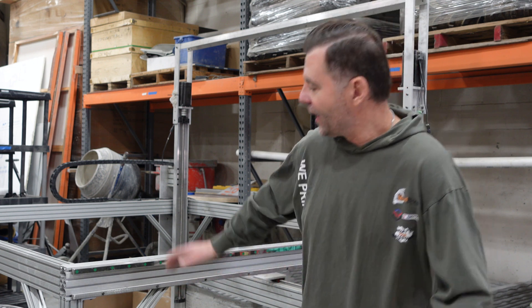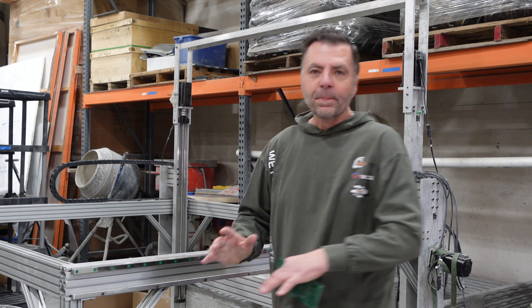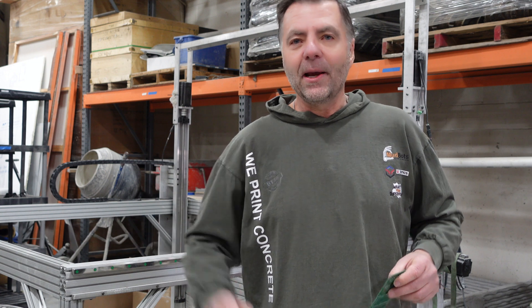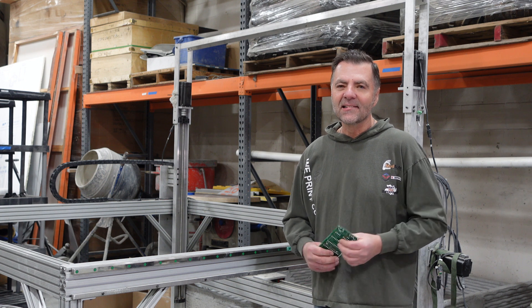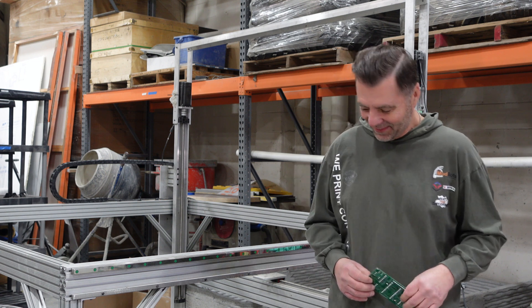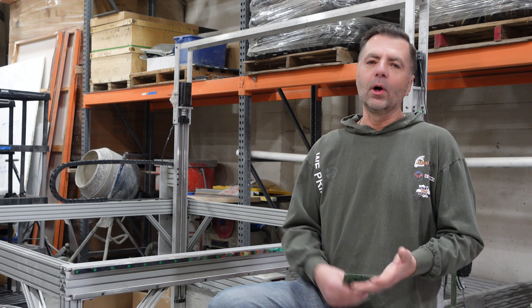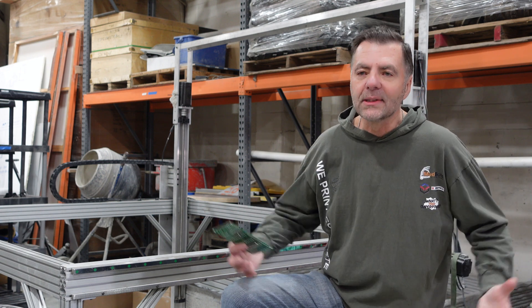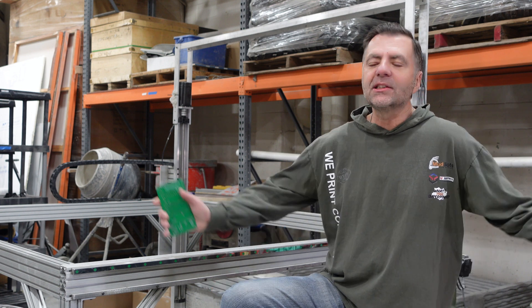With this printer, if I'm mixing the same ingredients for this printer versus a 50x50 printer, what comes out the hose is not the same. A lot of people fall in love with 3D printing and are ready to buy a printer, then they realize they also need a mixer pump system. The printer doesn't work without years of chemistry — sensors, temperature, hose diameter, hose length. Every time you change one part of that, everything changes.